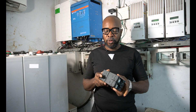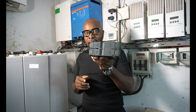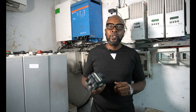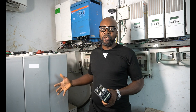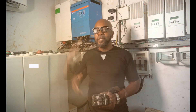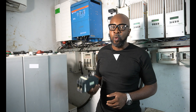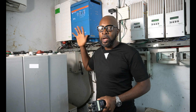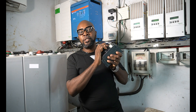I use this a lot for my battery connection — the line from the batteries always passes through this device before it gets to the inverter. One reason you need this circuit breaker slash surge protector is the large amperage involved with multiple batteries. If you connect directly and your hands are not steady, even a slight shake will cause a spark, and that spark kicks off a surge that could damage your charge controller or inverter. Installing this circuit breaker gives you a smooth transition.